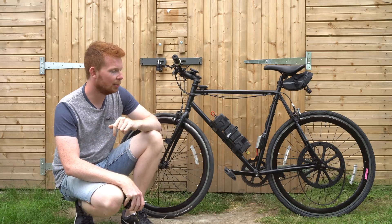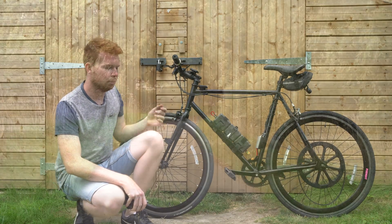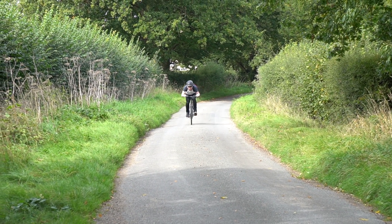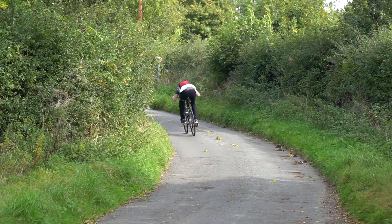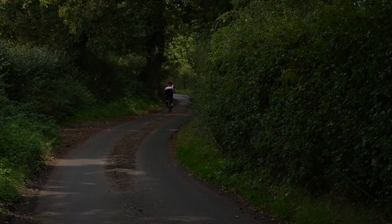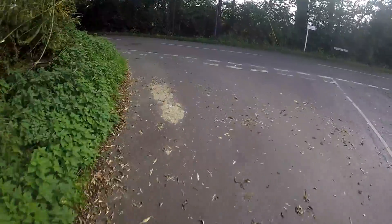Now there are a few issues with this bike, the main one being the brakes. Having V-brakes or rim brakes on a pedal bike that can do 36 to 38 miles per hour just doesn't work very well. The brake pads wear out in about two weeks if I'm riding every day, slamming on the brakes at 38 miles an hour and stopping down to zero constantly.